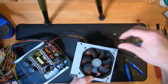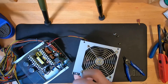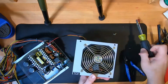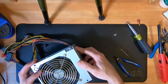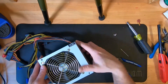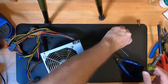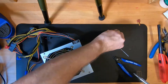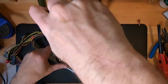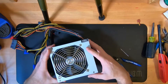Another thing I'll do here is reattach the fan back to the cover of the power supply. Next, you just line up the case with the body of the power supply — the sides of it will tuck into the side of the body. Once that's done, just put the four screws back in, and then you're done.